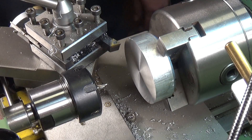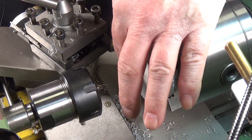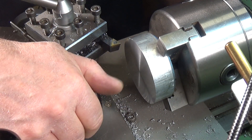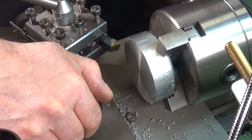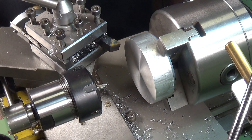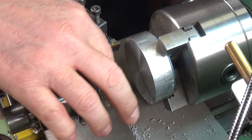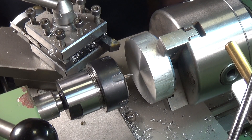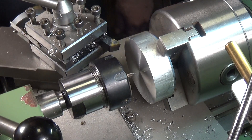I've moved the camera angle so hopefully you can see this a little bit better. The face is machined up very nicely, so now it's time to centre drill this. As you can see I'm actually using the centre drill in a collet. If you've got a collet chuck, definitely use it because it's far kinder on your drill bits and your centre drills than a three-jaw chuck or a Jacobs chuck is. So let's get this moved into place and centre this. We don't need a particularly big centre drill in there because we're only drilling it a quarter inch.